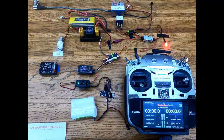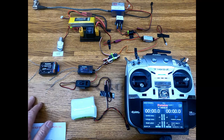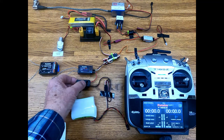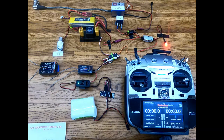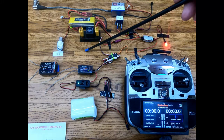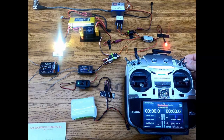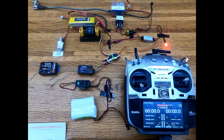Now one of the safety features is: let's say our radio is on and we shut the airplane off. Our radio is still on — we're still in start mode now. And our ignition comes on, as you can see, but the starter did not. So to get it out of that mode, we just simply turn it off and cycle it back on again. Hopefully your motor starts and you're ready to go.